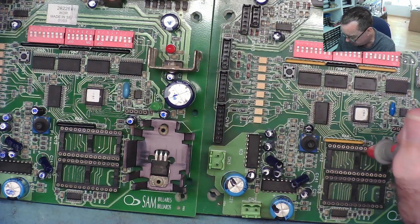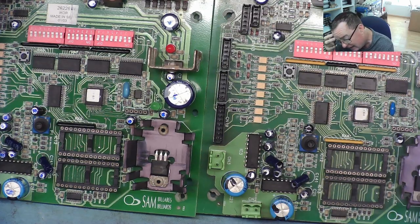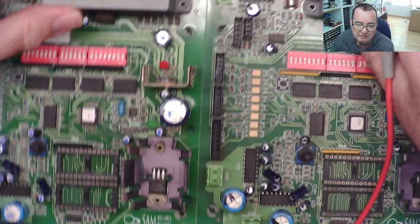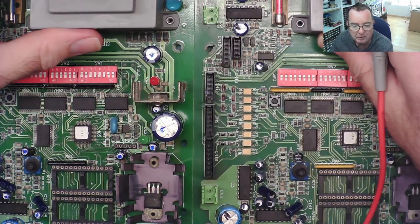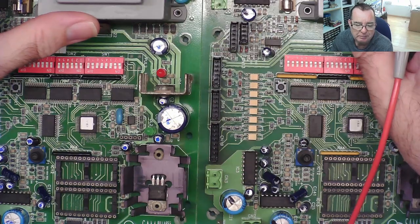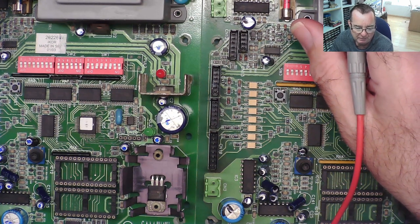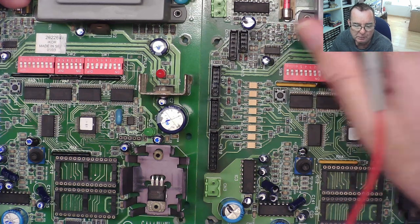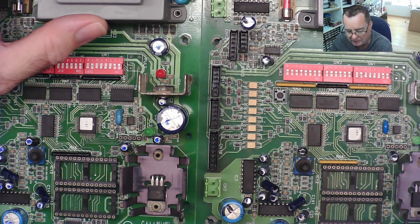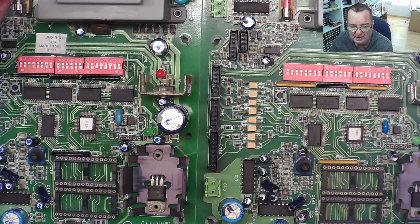Yeah, I can also try both or all three of the EEPROMs and the good one. Can I determine if I have two faulty EEPROMs? If that's the case, then I have one good one. It's whether I can find some way to read it. I don't recognize the part number of that EEPROM. Hopefully some of you guys can actually tell me what that is. I've tried the other two in my EEPROM reader and it's slightly reading the same value from every location, or maybe the same value from the first couple of rows or so, and then a different value from all the rest. So I really don't want to put the good EEPROM in the EEPROM programmer in case I damage it, because I haven't got a replacement. I've got no way to replace that. The only thing I can do is find the part number, figure out how to read it safely, read it, and then program some new ones if I can get the correct parts.